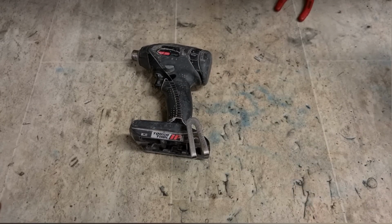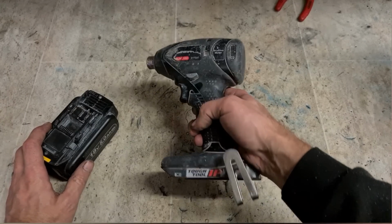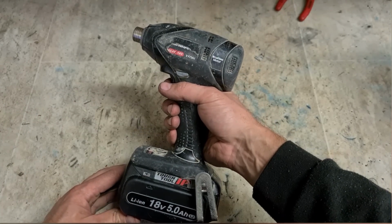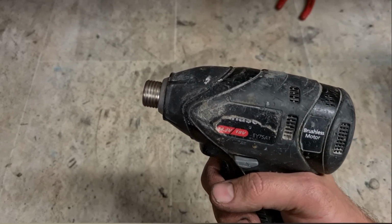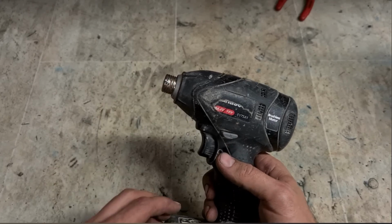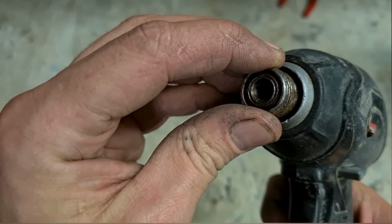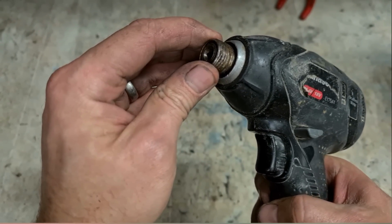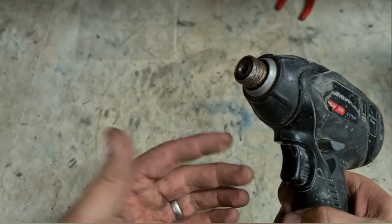Next up, another Panasonic. We get them very often. There's quite a few in today for some reason. Can you hear that noise? Everything's working. The chuck is making a really grumbling sort of sound. That's a very simple one. The actual steel bush and the spindle have worn out a wee bit. A wee bit of play now.